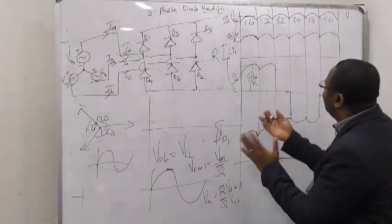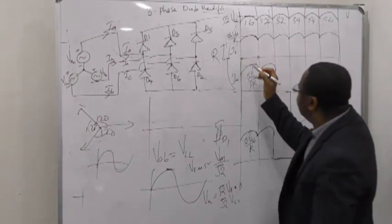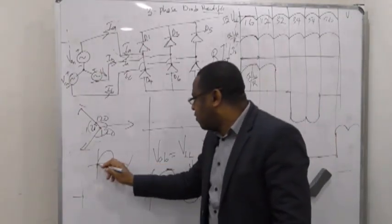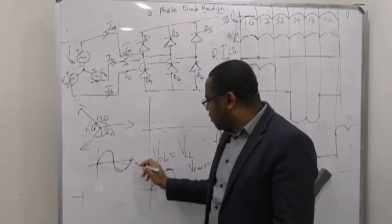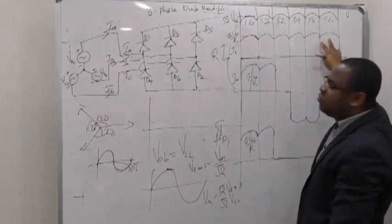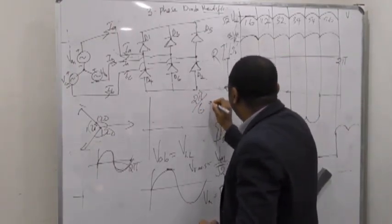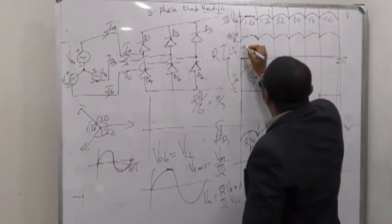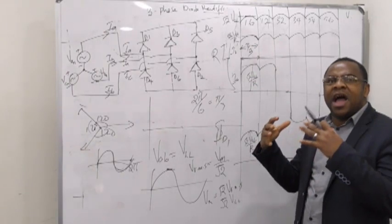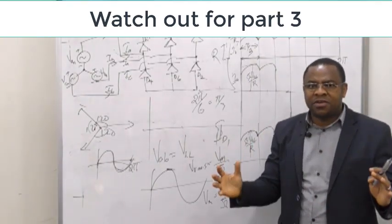Another thing is to see the timing, the time between this point and that point. Remember, the whole of this from here to here we derived for one full cycle, which is 2 pi. Now how many pulses do we have? 1, 2, 3, 4, 5, 6. Six pulses. 2 pi divided by 6 gives pi over 3, so from here to here is pi over 3. We are going to use this to derive the RMS value and the DC value of this signal. Watch out for the next video. Thank you.